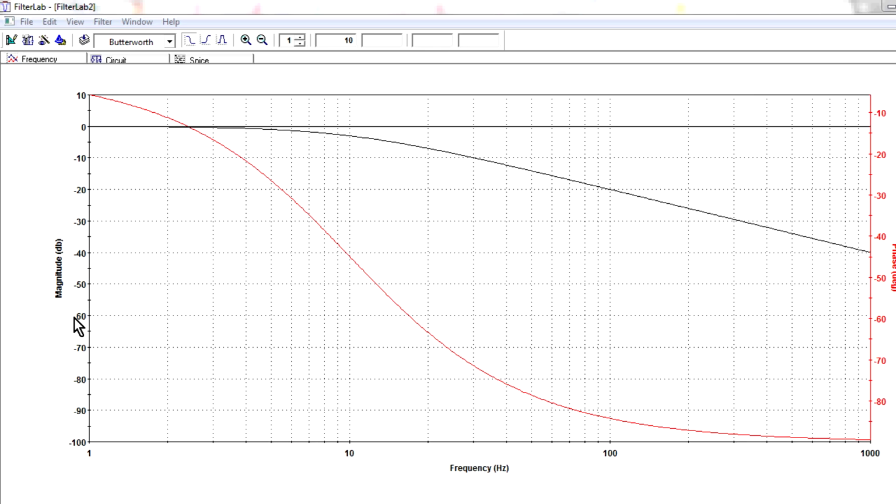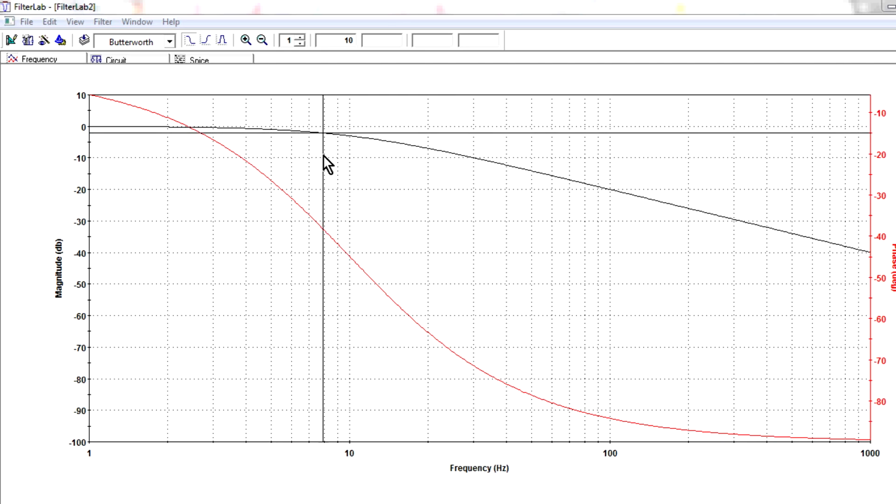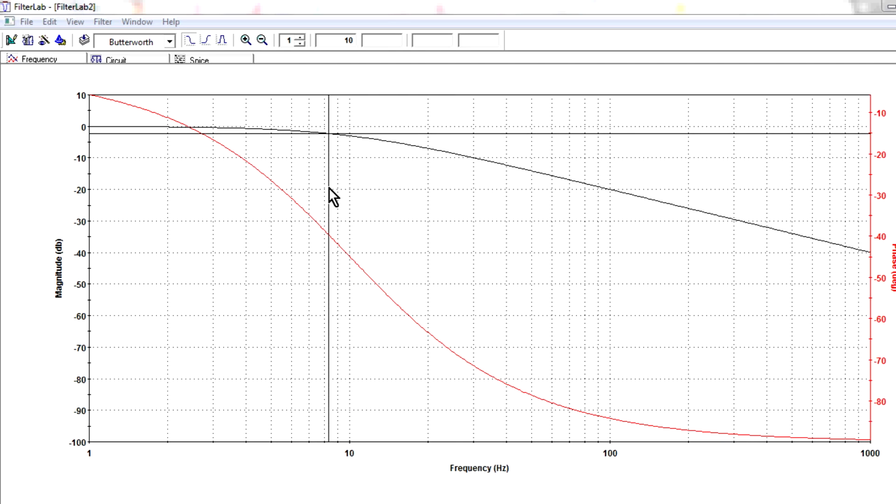So that's 1/1000th. That's the attenuation. So you feed in 1 volt, then you're only going to get 1 millivolt out. Now, just to be clear, that 1 millivolt I'm talking about there, and these levels I'm talking about, they only apply to a sine wave at 10 kilohertz. So basically all this filter talk we've been talking about doesn't actually apply directly those amplitudes to the PWM.